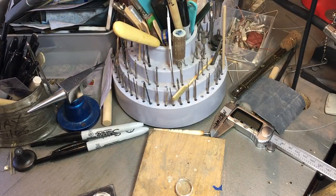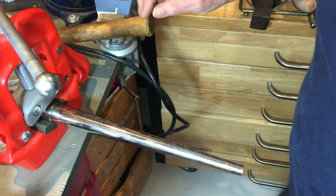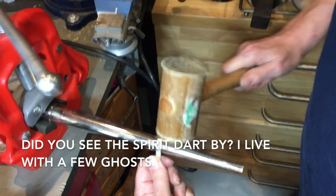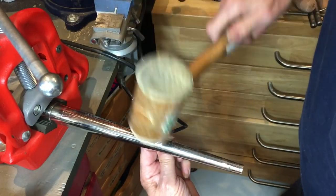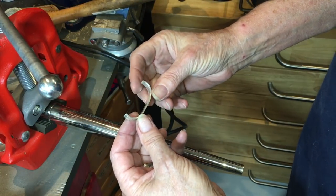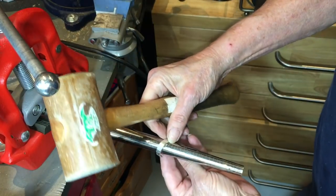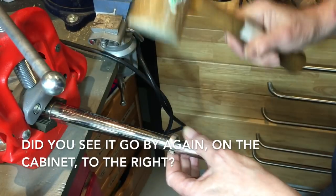We're going to move over to the traditional way of doing it on a pipe vise with a ring mandrel. I'm going to go up to about a size 7 and curl these edges. This is a conical shape, so you want it even — you can count and do this evenly. See how we're starting to curl around. I'm going to go back to 7, maybe 6 and a half. Just moving in towards the center. I'm going to move up to 6 and really whack this.